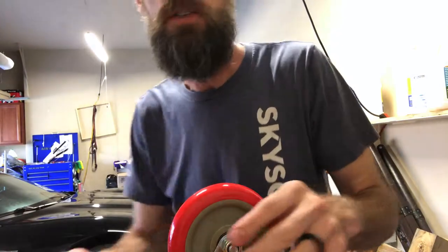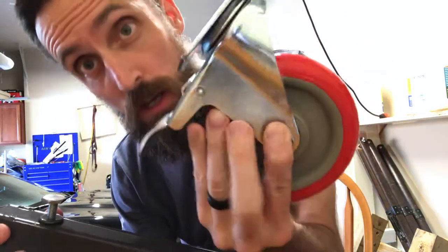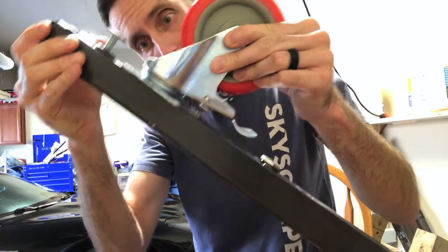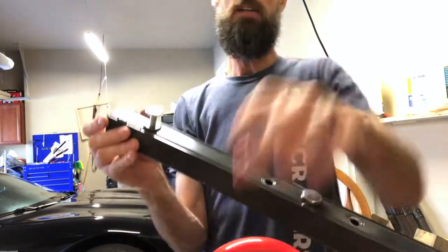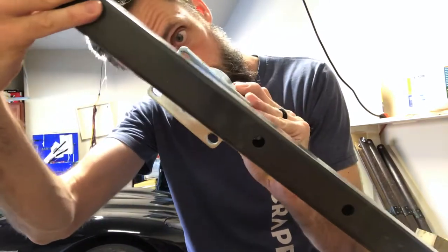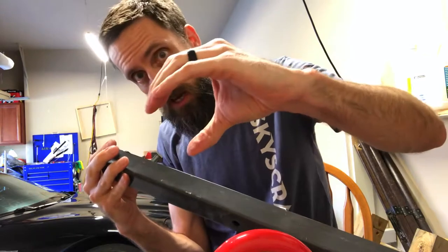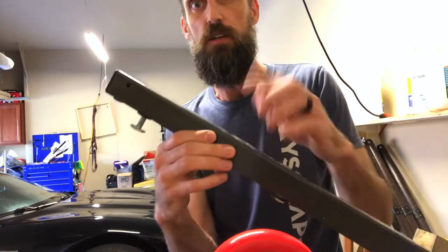All right now folks, here's the deal. I'm trying to mount these here 350-pound heavy-duty caster wheels. They not only lock the wheel but they lock the turning to the bottom of these. But I could not find the correct size of U-bolts for this application in the hardware store. The bolt holes line up on both sides perfectly, but the U-bolts I found were actually U-shaped — not squared off at the top — so they weren't going to fit on this square bar.